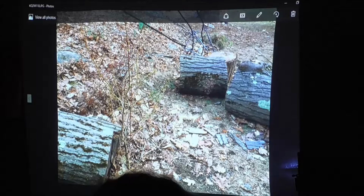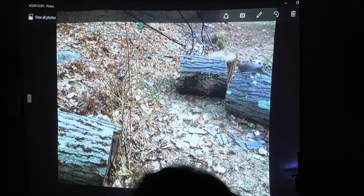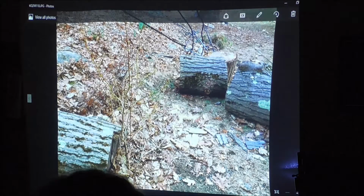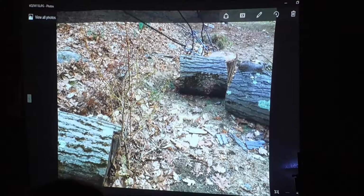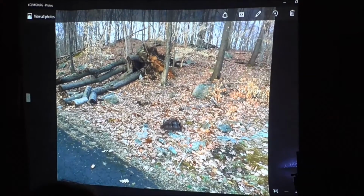And in my case, one of the guy wires, just because of where it had to go, is 160 feet from the tower, versus other ways where it's 100. So there are differences in forces, and that's on the big tower. But again, you put them where they have to go.